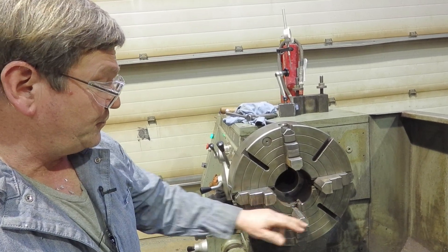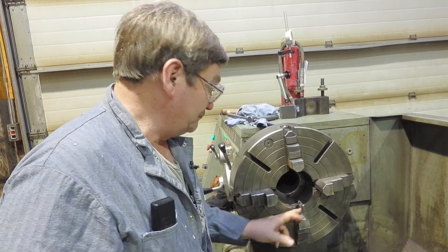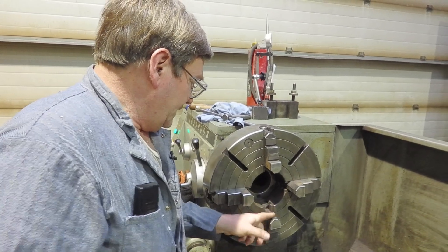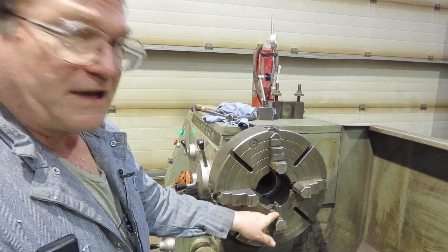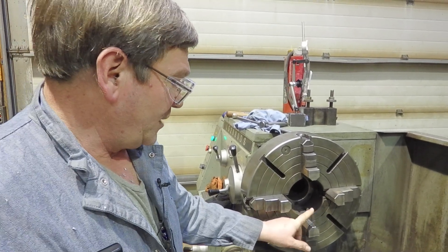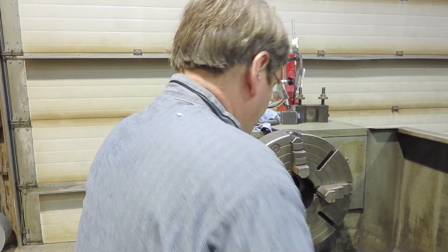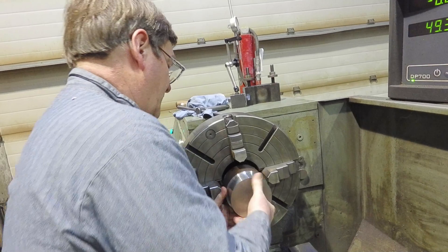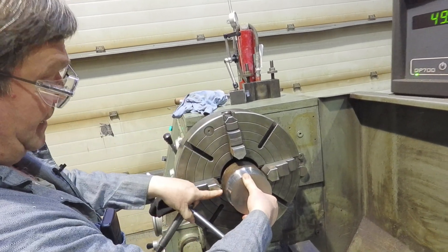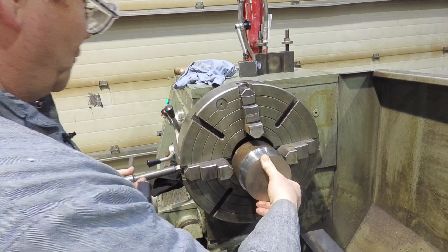On these ones here, which are pretty common on import lathes these days, and some of the other four-jaws too—the Polish ones—they're relatively smooth with just a nice curved jaw. It's not going to grab as good as the ones with the big serrations, but there's an extra benefit besides not tearing up your work. Put your stock in there and let it roll and just kind of center. You can notice that I'm above center here yet, but I'm closer to knowing where center is than with no guide at all.